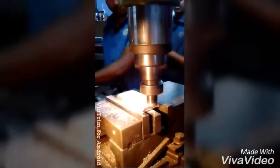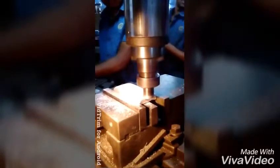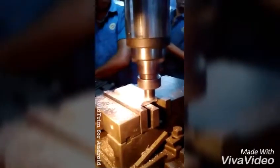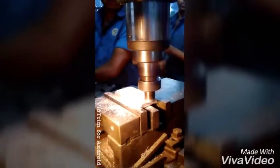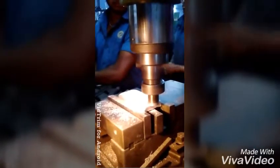The rotating shoulder creates friction heat and welding pressure between the tool and workpiece. When the tool descends along the path, the rotating pin contacts the surface, and friction is rapidly produced between the tool pin and the metal surface.